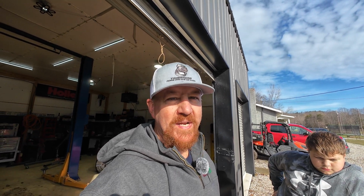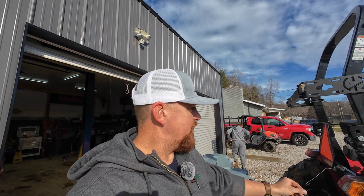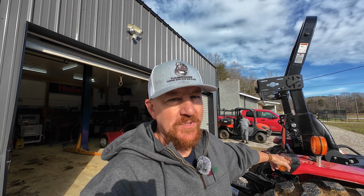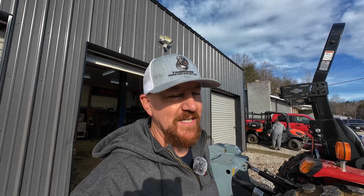Now, just to be honest with you, I'm not sure how much burning in they need or how much that actually slipped. So I'm gonna do that just a couple more times just to be sure before I tighten it back down. And then the other thing is, I am going to go ahead and tighten it back to the factory specs of 2 turns tight and test it. And I'll take my wrenches with me, and if it's still stalling the tractor, then I can loosen it up. But it may be that the clutches were just stuck from the factory, and that's why it was killing the tractor. We're gonna just tighten it back up to 2 turns. It's really easy to lighten up the load on these springs, so if we need to, we can do that while we're up there working.